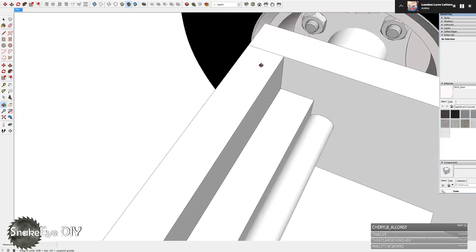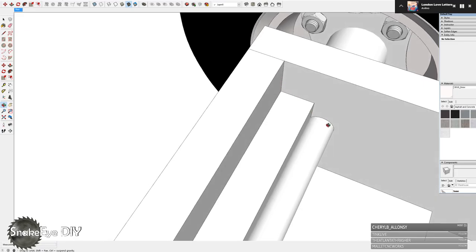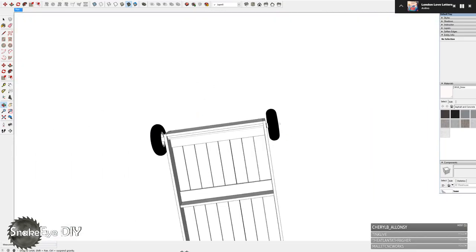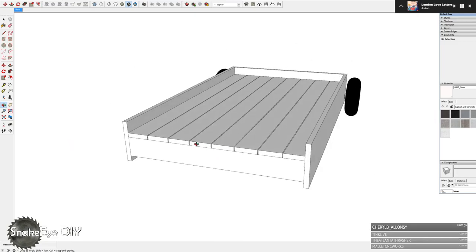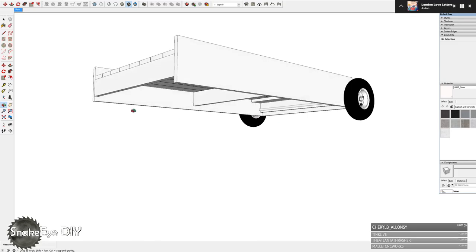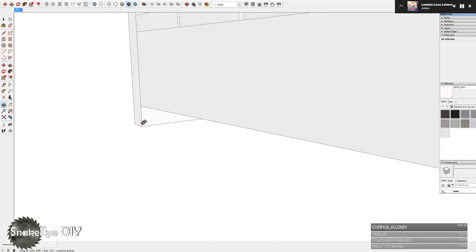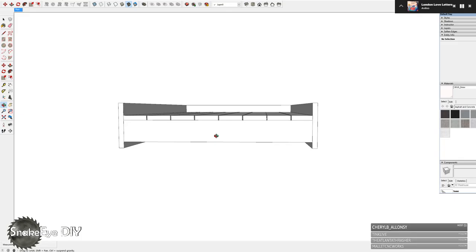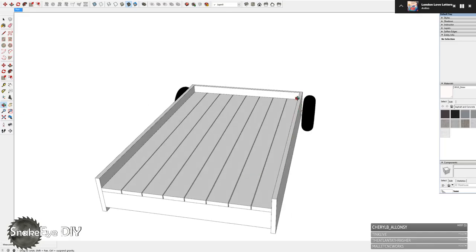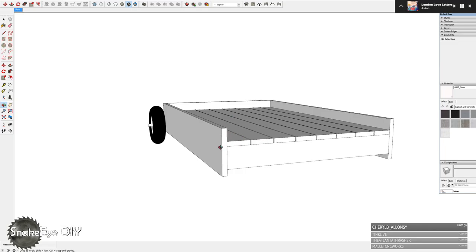I don't know how I was going with that. All right, so the bottom is essentially good. If you wanted to make this look a little nicer, you'd just buy a bigger board and rip it down to match. But I wouldn't do that personally, because I'm designing this right now based on dimensional lumber, so I would just buy this pre-made. And I wouldn't have to cut anything except for that one right there that was too long, and then all these to length. So right now this would be fairly minimal board cutting, because it would be pre-made.